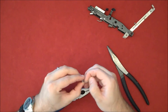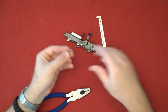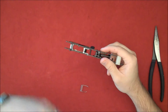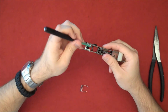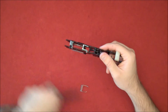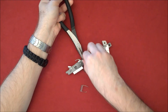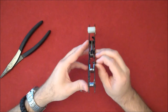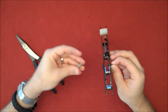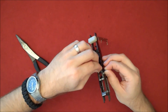That's a little bend — we'll start with that. The bottom section we'll leave until we get it in there because we might have to adjust the length. Now we need this new spring to sit around this detent here, which is easy to pull out. You can either use a flathead screwdriver and push it in here and pull down, or you can grab the top of it with some needle nose pliers, pull towards you, and then just grab it with your fingers and pull. Now with the new spring, we want that small end that we bent a little bit to be on this side, so just get the head of it around the detent.